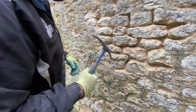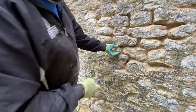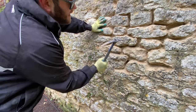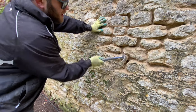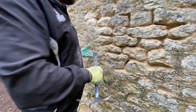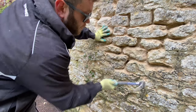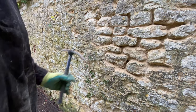What I see a lot of people do, which I don't personally think you should do - because it'll snap your hammer and you can easily move a stone - is they ram it in and then yank it out like that. Just tap it, slowly work it out. You've just got to work it really. The last thing you want to do is pull out a stone, especially on an old wall like this. I don't think it would take much to pull these out, so let's keep going.